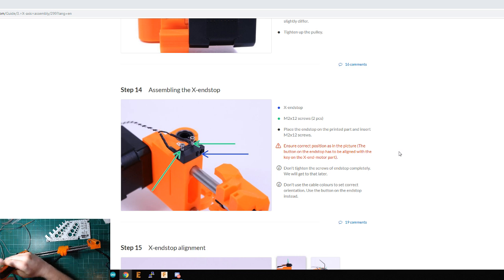Okay, so now that's pretty well threaded. The Ender's using 2208s. Okay, that's right. I think I heard Zambo say that before too. He used the 2208s with the SKR 1.1 board, but he had some issues with those drivers and that board in general, I think. He switched to 2130s.